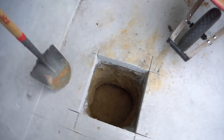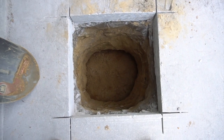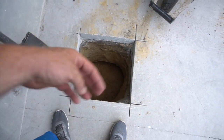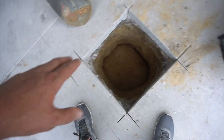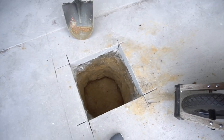After you start digging it out, we're going to go 36 inches down and then we're going to flange out the edges to maybe 20 inches or so. That way it'll give it better stability for the footer itself.